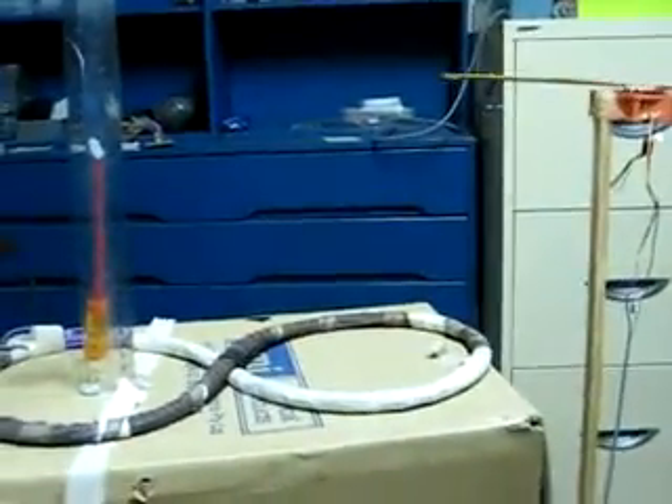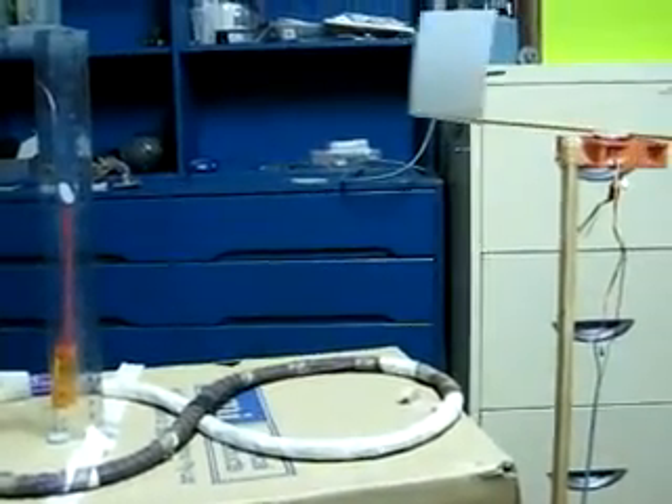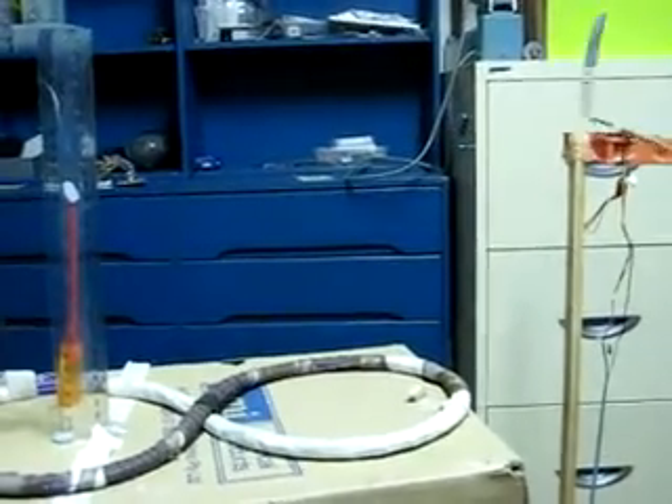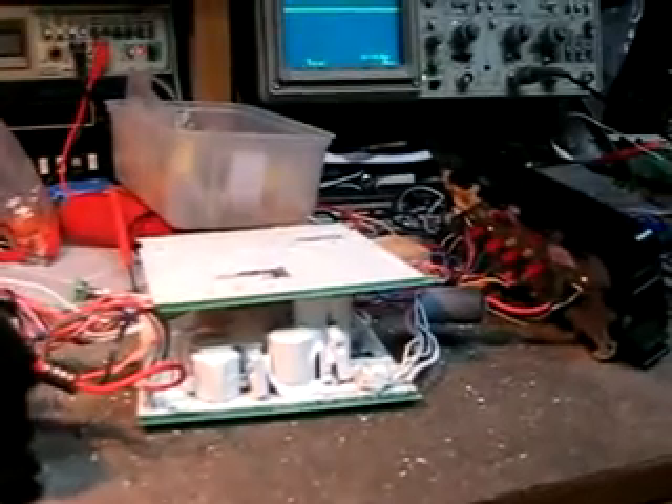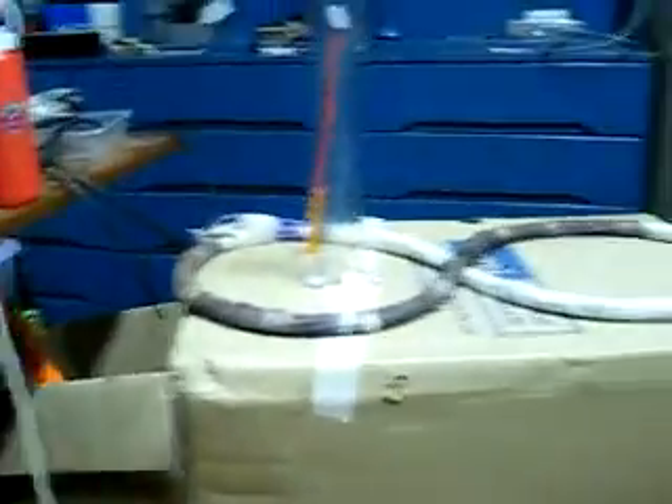We're connected up onto the GP 3000, so let it settle a bit. Now, the same setup. Listen to the signal difference. I've done a lot of work on the front end. I've put in a lot of better devices — lower resistance and lower capacitance. The detector's a hell of a lot more sensitive.